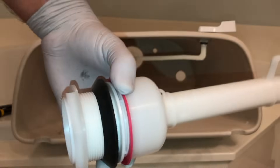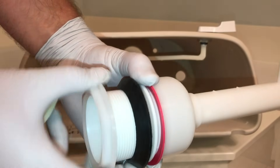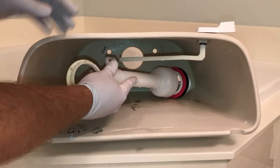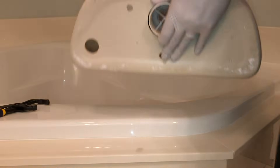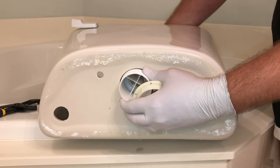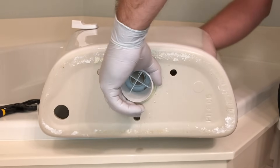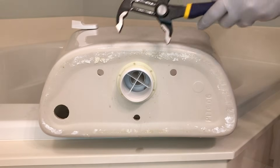We're going to start with the flush valve itself. Here's the replacement piece. The only thing we're going to take off of this is the hex nut, and I'm going to reuse the circular one. Just to show you side by side — hex versus circular. Take your new flush valve, put the flush lever through the arm, hold on to the new flush valve inside, and go ahead and lightly attach the circular nut. Hand tighten that as best you can, then grab your vice grips and tighten it up a bit.